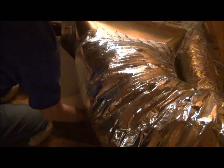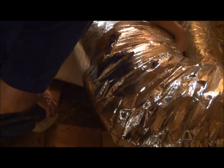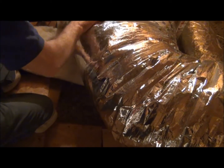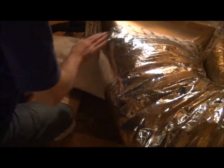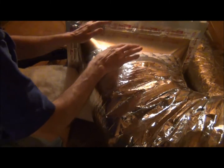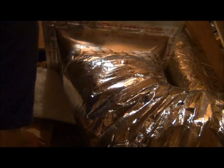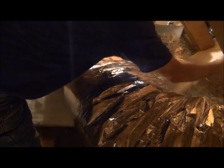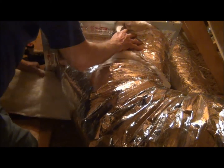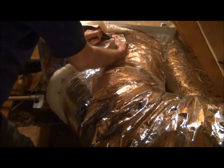Now what we've done here — this is a porous nylon mesh material that we have for our return air duct, same as our sound attenuating tubing. So we want to be careful not to have any foreign objects come into the return air through a leak. We put an extra layer of tape on there to make sure that we have an airtight seal all the way to the back. We also include a piece of insulation with the return air adapter we'll be putting on next. That will complete our return air assembly.